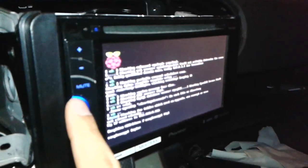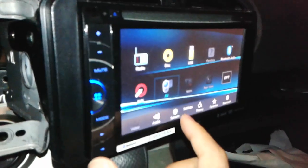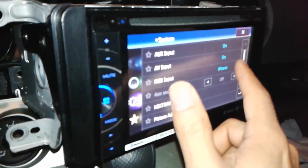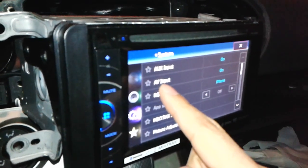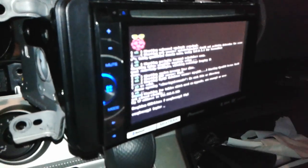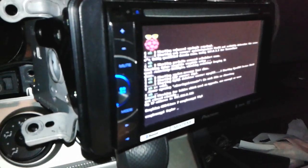After a little bit of working with it, I've got it working. This is the Raspberry Pi version 1 B, hooked up via composite video. I was troubleshooting for a minute, but I found out it was just the settings in the car radio getting me — I had to go into the system and actually turn on the AV input. Once I did that, voilà — got the Raspberry Pi screen up and going, prompting for login.